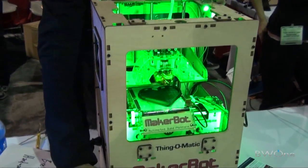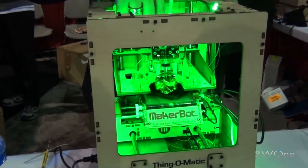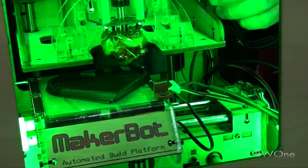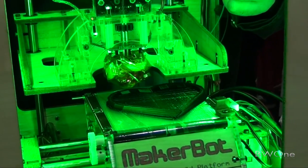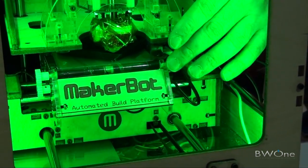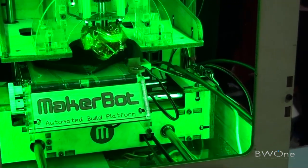The machine takes plastic from down here and it comes up through this thing right here and goes into the plastic extruder. It gets heated up to 220 degrees Celsius and just like a hot glue gun, it squirts out. It draws — in this case, it's drawing a box in the shape of a heart. It draws a heart and when it's done with one layer, it lifts up a little bit and draws again. Layer by layer, the object gets built up. When it's all done, we've got a conveyor belt on here and it'll just come to the front, spit it out, then go back and make another one. It's automated — it's a factory on your desktop. And it's really fun.